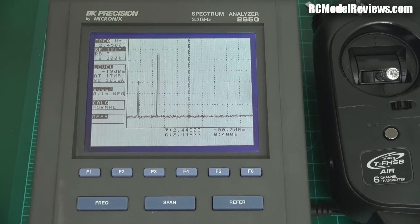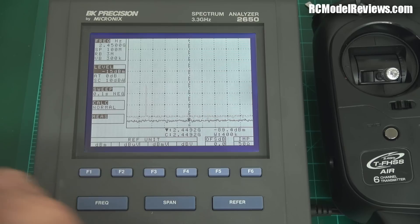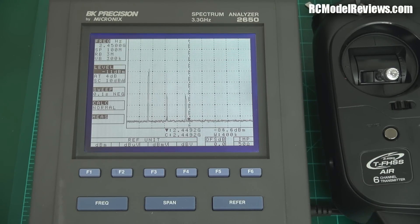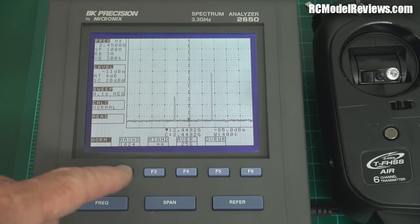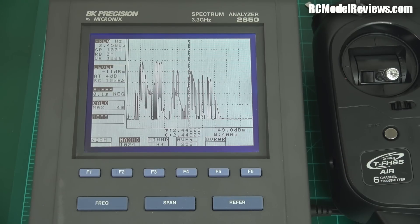We've got it on the spectrum analyzer — you can see it pinging away across the band. I'll lower sensitivity slightly so we can see the peaks better. At the moment the receiver isn't on, so this is just the transmitter pinging with nothing coming back on the telemetry protocol. I'm going to plug in the receiver and see if it changes the band usage. Receiver's plugged in — you can hear the ESC beeping. Now I'll change the persistence to max so it accumulates all the hopping, and you can see it spreading right across the band. This is a pretty robust protocol.